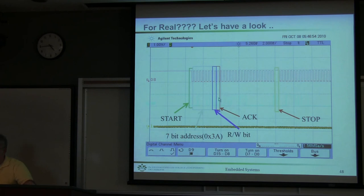And then it's requesting data. So let's look, how many bytes is this? Read-write bit is, I think it's down, right? That looks down. So that means it's going to send something to it, and then all the way at the end, it stops the clock and raises the stop again. And then somebody else is probably going to pull this down. It might be the accelerometer. I'd have to dig into this to see what it actually is saying. Looks like it's doing the same thing. The 7-bit address again is 3A. Looks like it's read again. So it might be send this, send this.